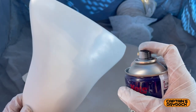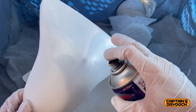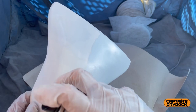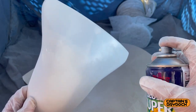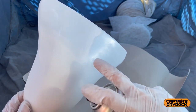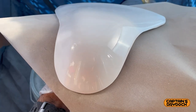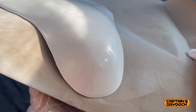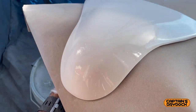The technique is to move across the surface incrementally, overlapping each pass of the previous spray, and not stopping mid-surface. You want to keep it wet as you cover the entire piece. Here's the result of the first coat — excellent. Now I'll wait for that to dry and apply two more coats.